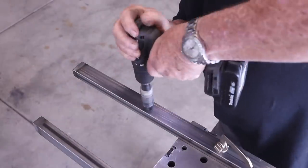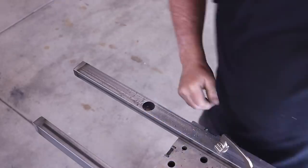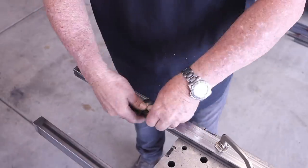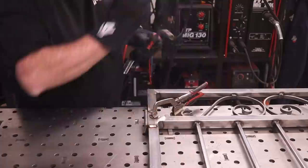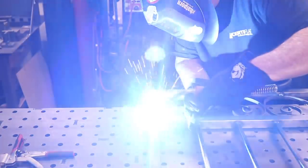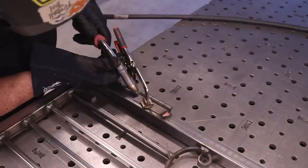Here's where I drill a hole — one inch and an eighth with a hole saw. You can see I've got these rubber plugs that fit right in there, which go in after the install is complete. That one-and-an-eighth inch hole allows me to get my socket in with the big bolts I use to mount to the wall, and I find that works out really well.